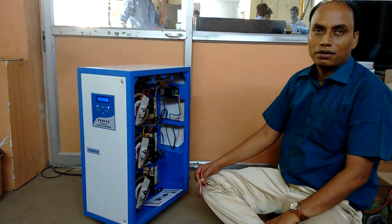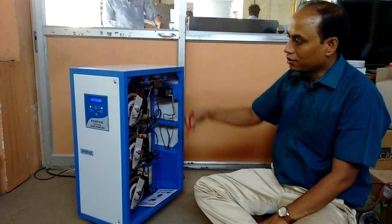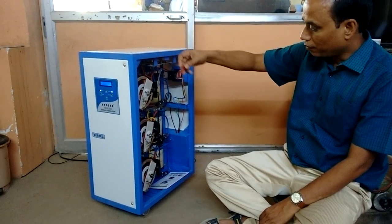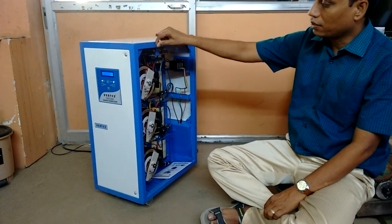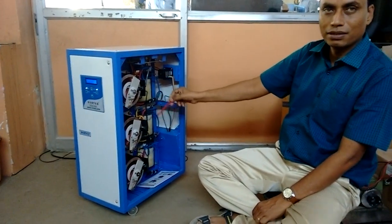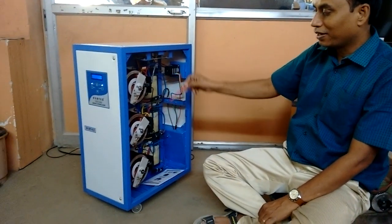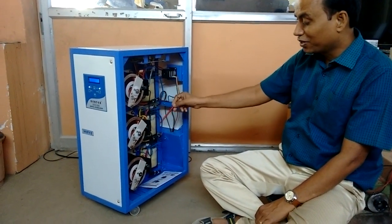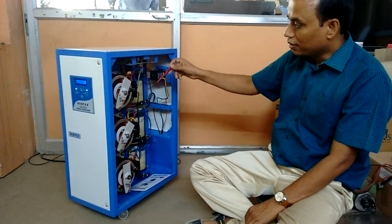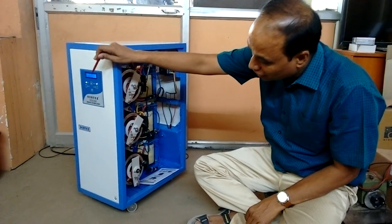Hello, my name is Vala Murgan. We have been in the field for the past 25 years. This is called an air-cooled voltage stabilizer. It employs transformers — this transformer is called a continuous variable transformer. It is used in the three-phase stabilizer. The main purpose is to stabilize the electrical power, whether used in houses, industrial, or domestic applications. This has three independent phase correction with one display unit.